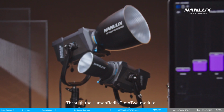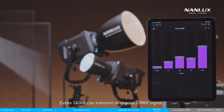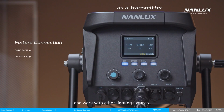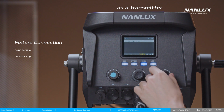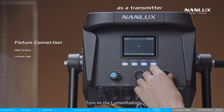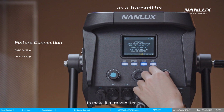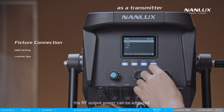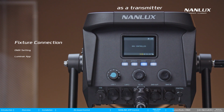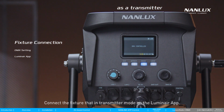Through the Lumen Radio TIMO 2 module, Evoke 2400B can transmit or receive CRMX signal and work with other lighting fixtures. Turn on the Lumen Radio. Set the radio mode to transmitter mode to make it a transmitter. When the fixture is in transmitter mode, the RF output power can be adjusted. Connect the fixture in transmitter mode on the Luminaire app. Connected successfully.